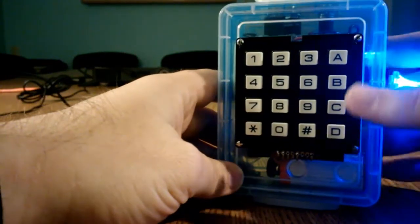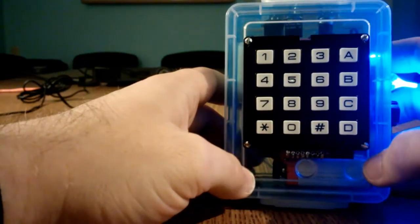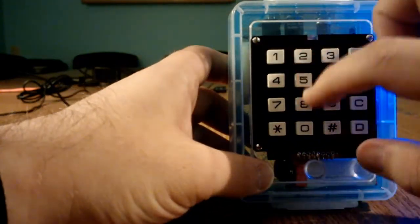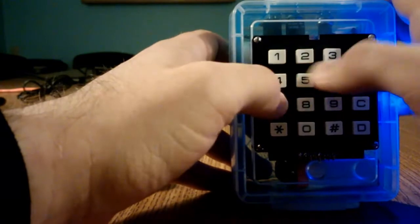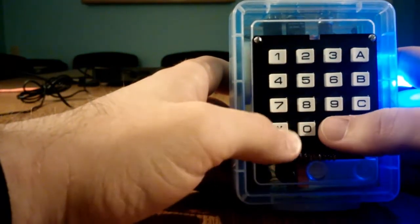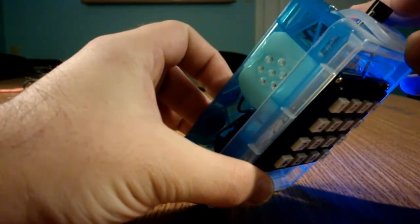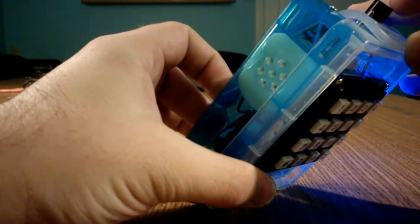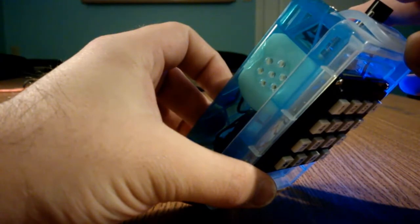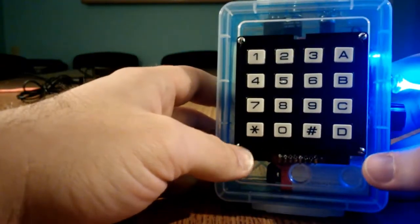Let's switch into international mode. If you hold in A, you'll hear two tones. That's 440 Hz. The two tones signify that it's now in international mode. Everything on the keypad here is exactly the same. The KP and ST are different, though. They sound different. Also, the supervisory signaling is different as well. That's 2600 Hz and 2400 Hz, a pause, and then another 2400 Hz. This is used for basically international switches and things.